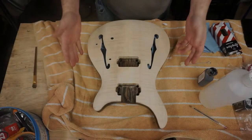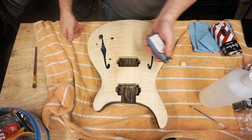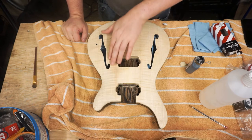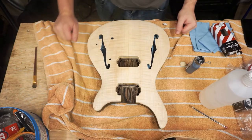and I'm hoping that I can work them in there at some point as well. The obvious way to make use of these dyes would be to use the black to put an initial coat on and then rub that back until it's to the point where it's accentuating the figure and giving a lovely 3D effect, and then put the colour on top.